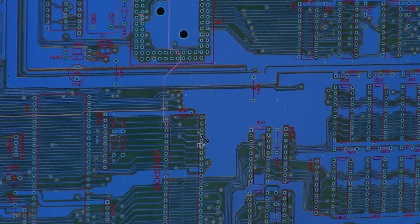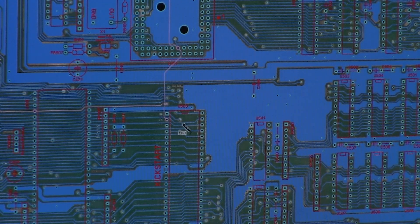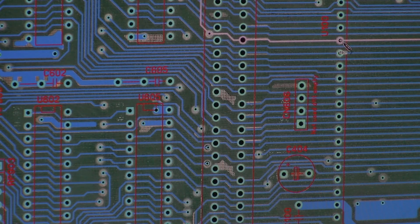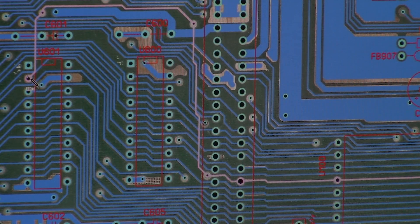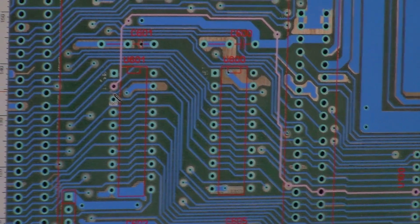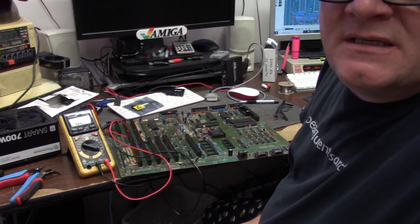So what I'm going to have to do is continue on this tracing. This is an A2000 motherboard — I was literally on this pin here. You can see the pink line blinking — that's the trace. I touched here, went to this little pin, and went over to the fourth pin on the ROM. You can get really granular with zooming in, seeing from the fourth pin to the CPU riser socket. So I'll go from ROM pin 2 to U601 pin 2 — that tests that entire long run. It's about a four-hour journey.